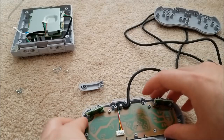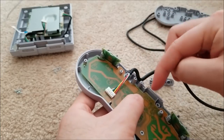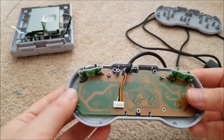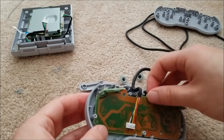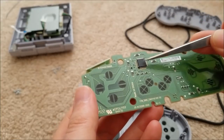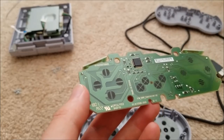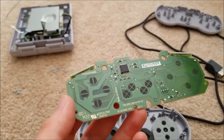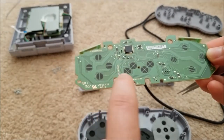It feels really good honestly. As noted, this is an I2C connection with some strain relief wrapping around. Removing the rubber conductive pads and prying the board out carefully — here's the parallel-to-I2C bridge chip. This chip takes your button inputs and converts them to the I2C protocol used for the controller. These controllers are also cross-compatible with Wii Classic controllers, which is pretty neat.